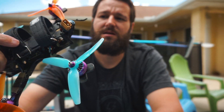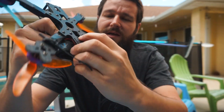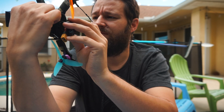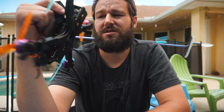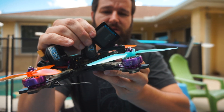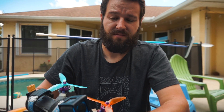I'm running a Crossfire receiver with an Immortal T antenna. There's a cap in there — just a 35-volt 470 microfarad low-ESR cap — I don't even think it's needed; I've only put it on a few builds and it doesn't seem to make a difference. For HD, I've got a fancy Brain 3D-printed mount. I run my camera angle at about 25 to 30 degrees, although lately I've been experimenting with less tilt to see if I can get some cooler effects.